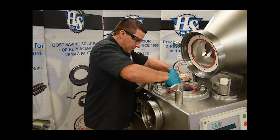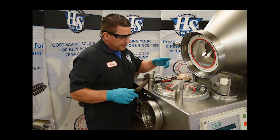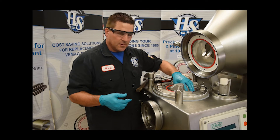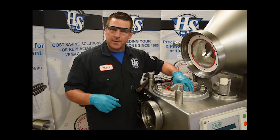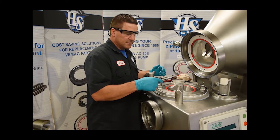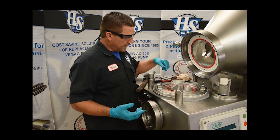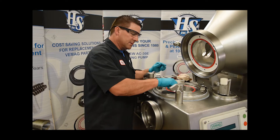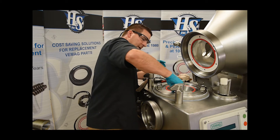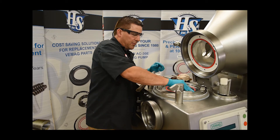The bottom one should do the same — it just pushes. If you put a little bit of grease on them, they just push right into the groove. If you don't grease them, then you have to tap them in with a dead blow hammer. When you start hammering on this, sometimes people don't grab a dead blow and they'll use a ball peen hammer and start damaging these surfaces. So I like to just fit it by hand if I can — that way you know there's nothing binding and it fits right into place as it should.